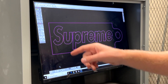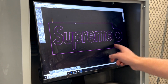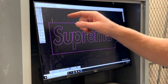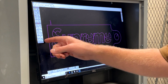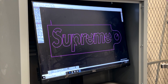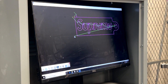Next we're going to set the lead-ins. Lead-ins means the nozzle ramps up pressure to cutting pressure before it reaches the cut. Go to lead-in and click anywhere outside of the material, because you don't want the cut starting inside the lettering. We want the outline cut out, but not the letters themselves removed — so the lead-in goes outside. We'll need to do this for each letter as well. Now that all the lead-ins are placed, press Auto Path — this determines the route the cuts will follow. Press Post, then decide where to start. Cut the letters first, work from the inside out, and then cut the outside, because you don't want the water blowing away a piece that's already been cut.